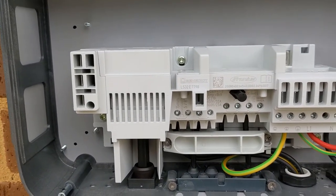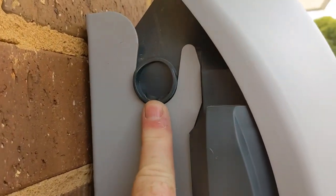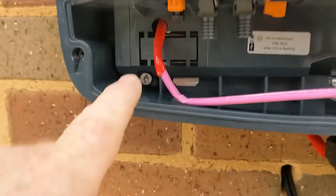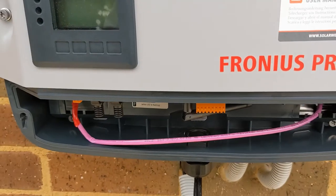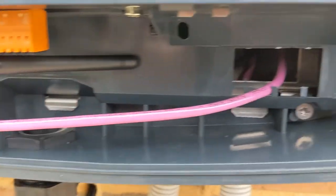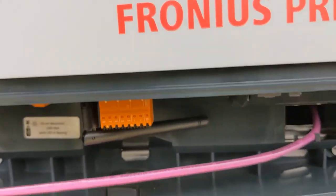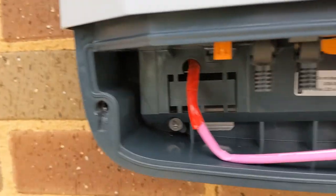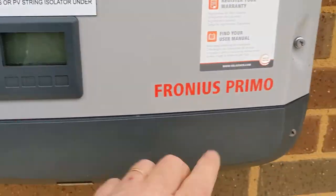We've got that piece back on. The little connectors just slot on. We just need to put back the mounting bracket screws and then put the cover back on. Mounting bracket screws are back in and tight — a good indicator is that those screws drive up easily. If there's any kind of resistance, you haven't got it seated right. Cover back on. Everything looks good.